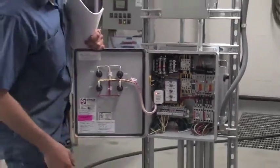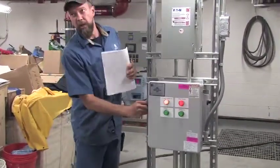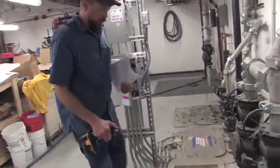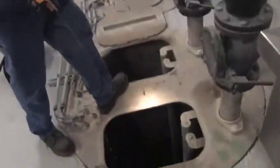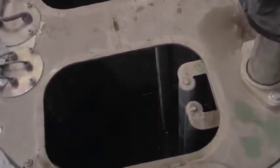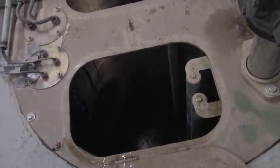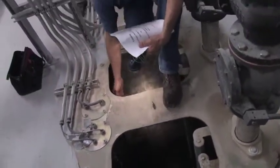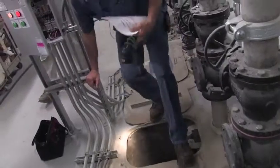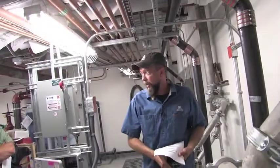Terminal strip with your level controls, motor starters. You also have an alarm test and silence switch here, the horn, and a silence button on the side of the panel. The pumps — you've got five horsepower submersibles with the level controls. These are on rails for retrieval. You've got cables here so you can hook your retrieval right off the cable, or there's a handle down there and you can fish it and pick it with your chain hoist. You may want to plan on getting some sort of hoisting apparatus above in the future.